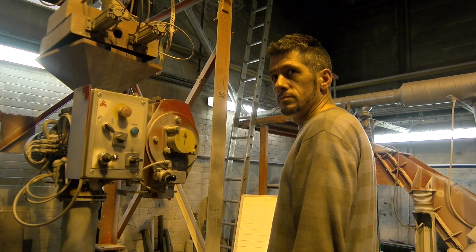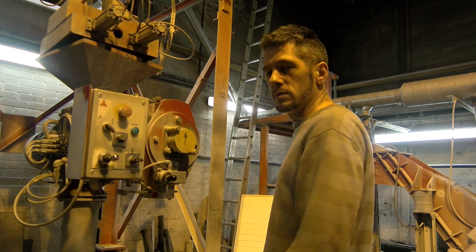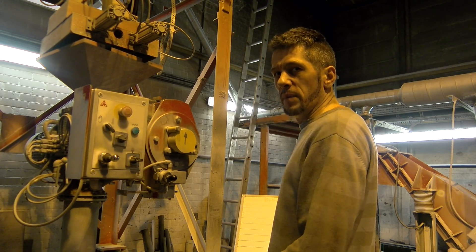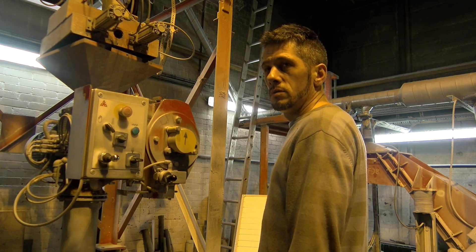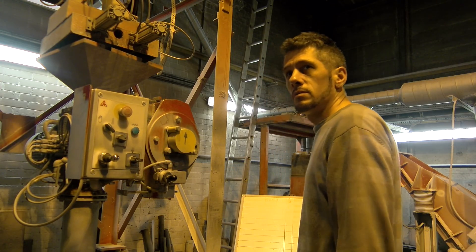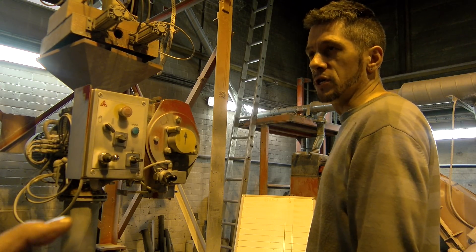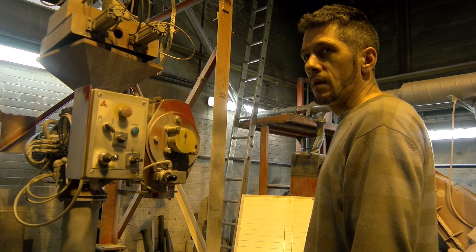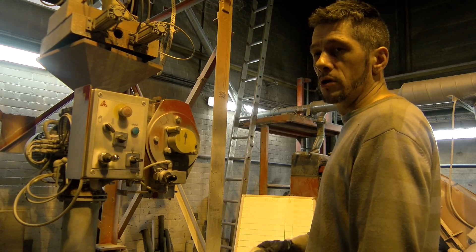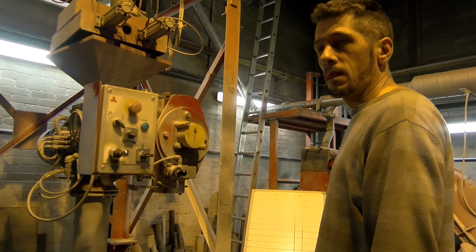We're now right at the workstation where Tony's busy making PPMGs. Just want to say a huge thank you, mate, for being here on a Friday. So tell us about this process — how long is each mould taking? About five minutes. And that machine you're stood in front of, you can set it for five, ten, or twenty minutes. It's about the air temperature, the amount of acid and resin in there, because this makes it ultra precise. So you've got your positive there — what happens now? You put a bit of mould release, put the carbon on to stop sand sticking to it, and then the sand goes up.